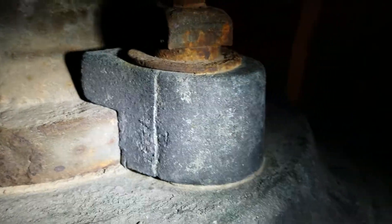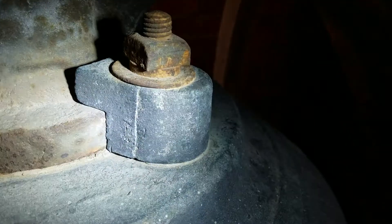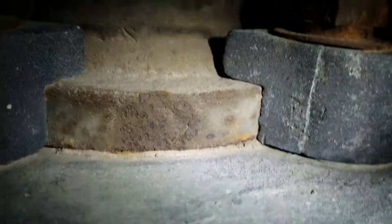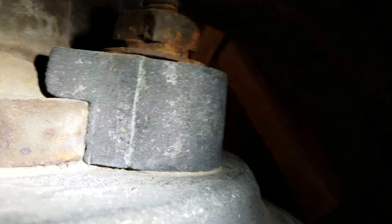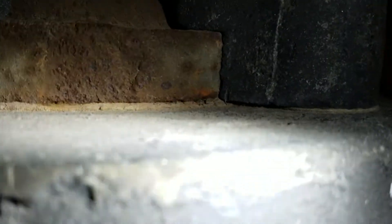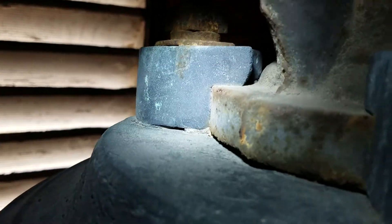Overall, these clamps — this part right here is the clamp — that looks pretty tight to the bell. As many times as clamps are actually angled, this one does not look angled at all. There's also a gasket right there in between the yoke and the bell. Many times that will dry rot away and that allows the bell to get loose. These clamps look nice and snug, which is the way they should be — snug against that rounded area of the yoke.